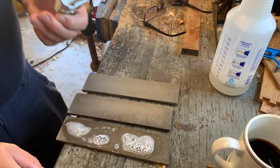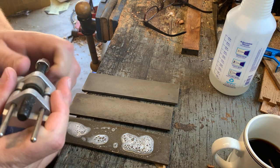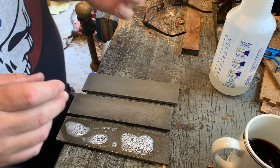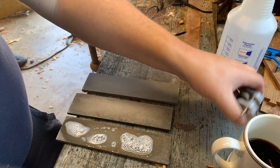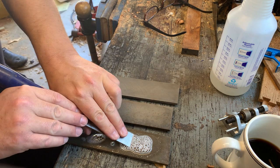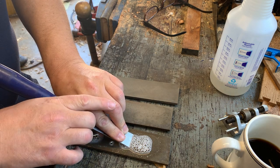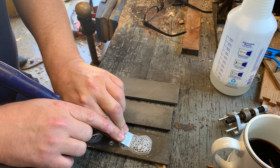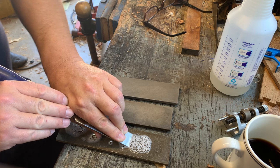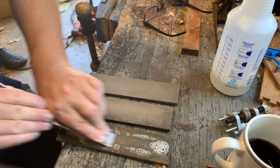If you need to establish a bevel, the easiest thing to do is buy one of these handy-dandy sharpening guides — I like these, just follow the directions. Right now I'm not going to use it because this chisel is in good enough shape. Apply even down-pressure across the end. I bend this finger to shorten it a little bit so that my two fingers are roughly in the same place. Hold it at about 30 degrees, feel the facet, and just take off a little bit of material.